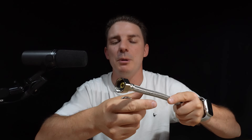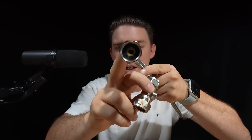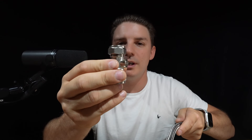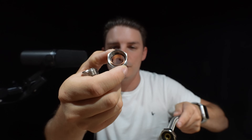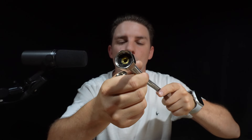This is the most common leak that I get called out to — it's where people are installing taps or toilet fixtures and what they do is put the flexible hose, which has a rubber washer on the inside, straight down onto an isolation valve which is actually designed for a copper pipe. This leaves a beveled edge on the inside because we have a nut and olive, and it's a very low, sharp surface area that gets put onto a rubber washer.